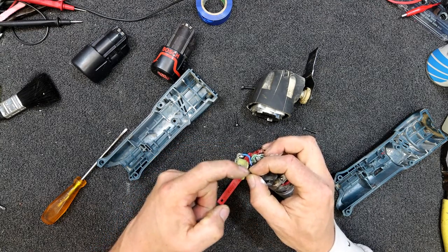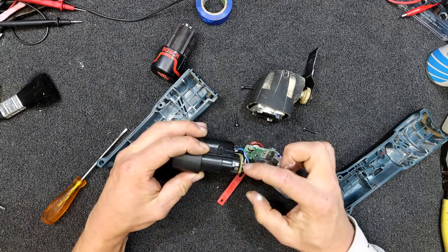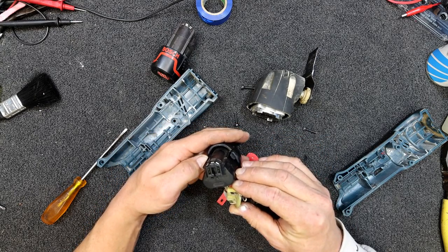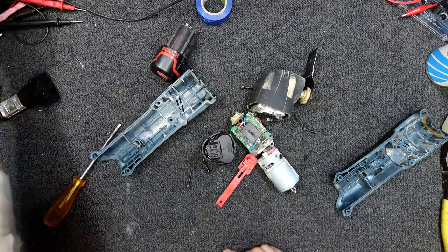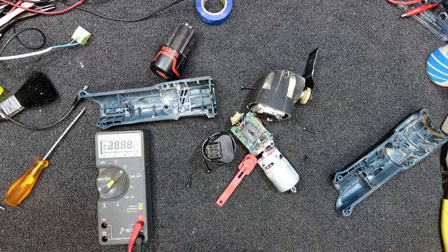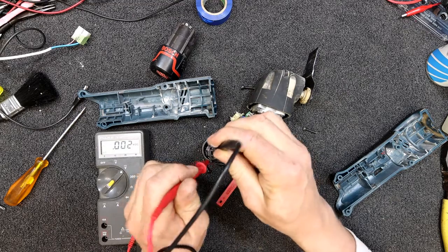And there used to be a little tab came out, so that when this battery went in, it touched obviously on that one there, which is labelled, what, T I think, wasn't it? Yeah, I think that's a T on there. So I guess one thing we can do is find out, does it actually connect? Because I'm not worried about bypassing this thing if necessary, since it's obviously a weak spot. I guess I could find out whether we can actually get a new battery terminal for it is another thing.